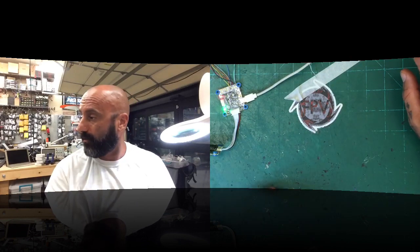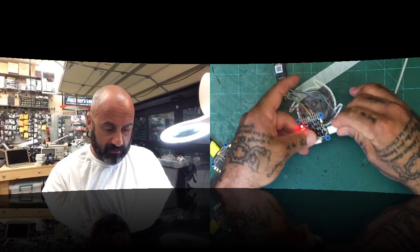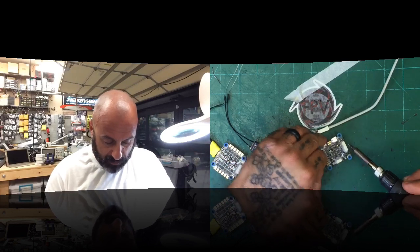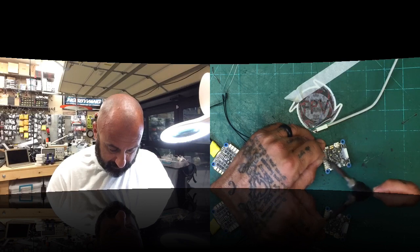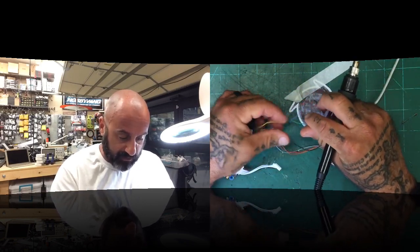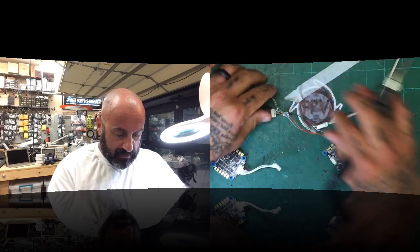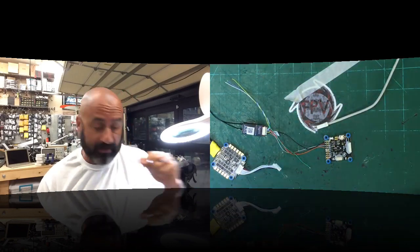So what we're going to do now is disconnect our flight controller. Telemetry lost. And we are going to now disconnect the yellow cable. I don't think I'm going to need to do much. I think I'll just try to hold this here. Disconnect. All right. Now what I'm about to do would apply to people that do not have an inverted signal. Let's say you have the R9 Mini, not the MM where they added the inverted S port, right? So let's just say you have the Mini and you're running an F4 board. Well, then you gotta go back to soft serial.